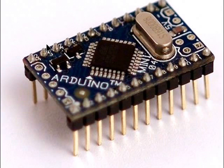This is another type of Arduino board. This is called a Mini. Your ATmega chip is actually this surface mount device in the center. This plugs into a proto board. You have to just look at how it hooks up. It also needs an external serial port converter circuit.